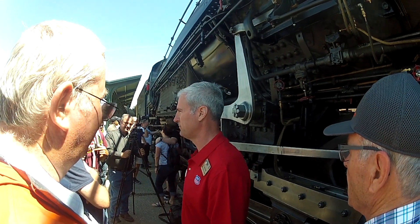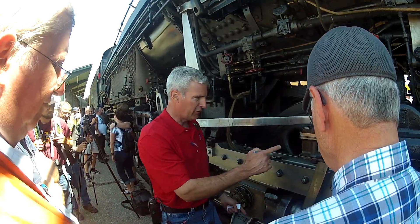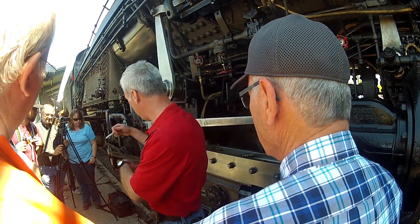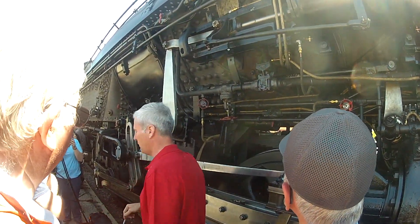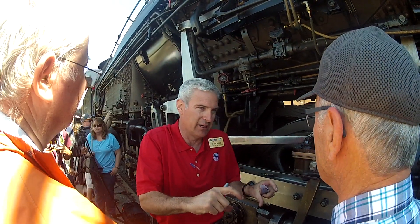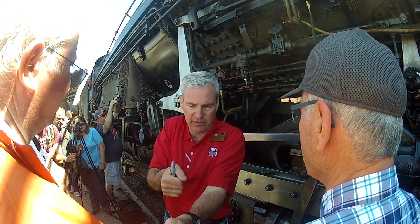It's got to be timed just right. Once it's locked in, it's dead — it won't slip out of time. All this stuff is designed very specifically, so if all these dimensions are the same, if something happens and one of these gets bent, well, that's going to change. Your center crank throw comes with all your measurements, the baseline is the same. We have to set this relationship right here — this is the shaft right there. We had to put the link blocks both down at a very specific point in the link, then measure the dimension between those two pins, take that off, adjust it to that precise dimension, and put it back up so both ends are in sequence.